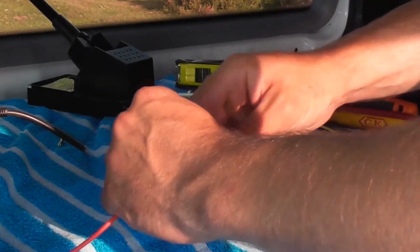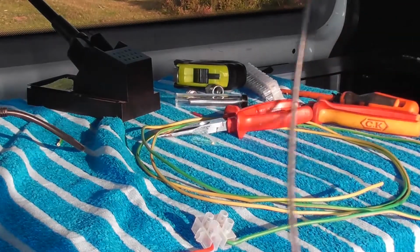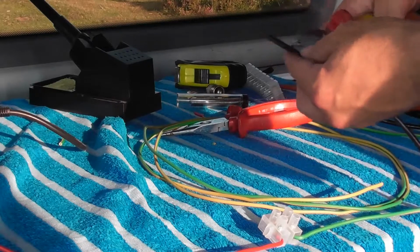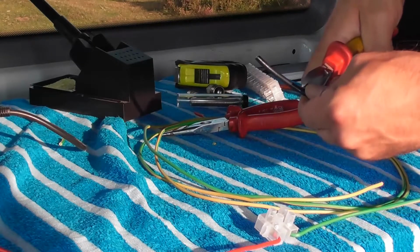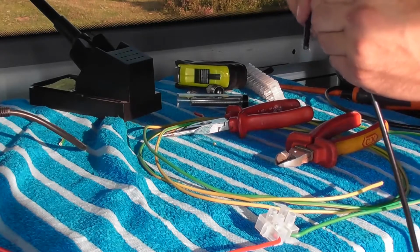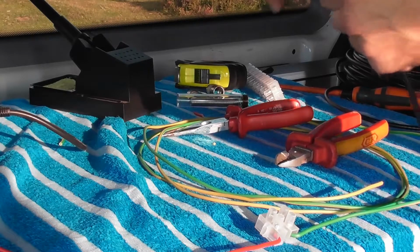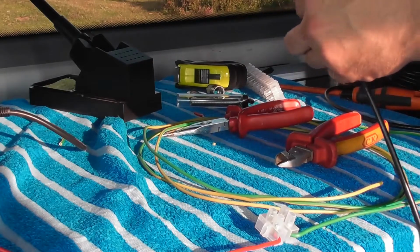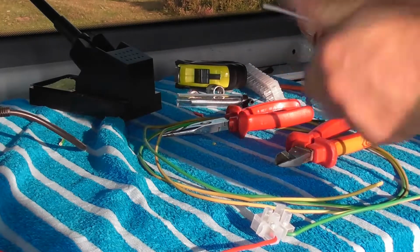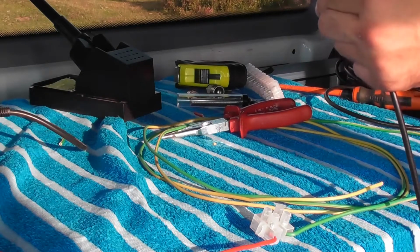So that's our two elements. Got a roll of coax, and what I'm going to do is take a little bit of the insulation off. Could do with a knife really, but it doesn't matter. There's a network on channel 28 UKFM, so I will be calling into that one and testing the antenna out. Take some insulation off the other side.